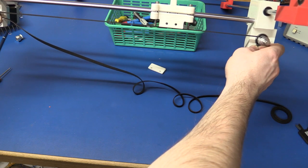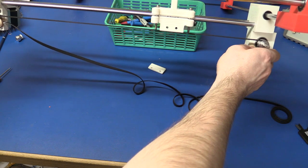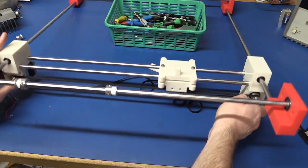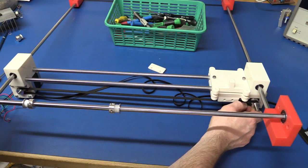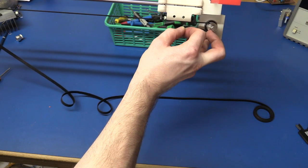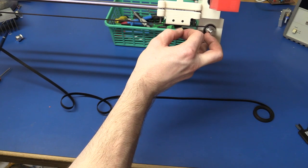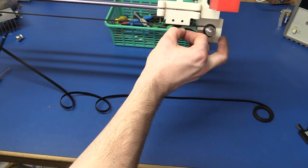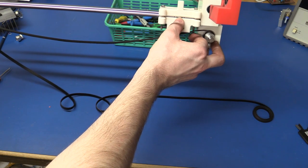And I don't know if you can see that, but it looks like it is a little bit too low, the printhead there. But let me try and move it to one of the ends. Well, that is not much, but maybe like half a millimeter. I think we will live with that. And it makes sense, because I think this gap is just a bit over 1 millimeter.